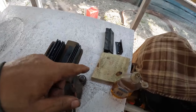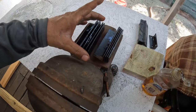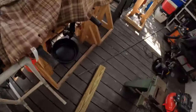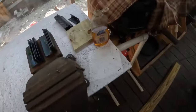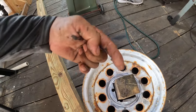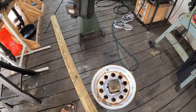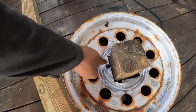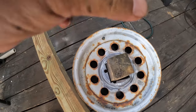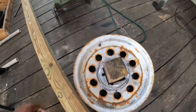I got eight of them out of that one little short piece there with a little bit of leftover, but I got my brackets for the base and then the brackets that I'm going to weld the rebar to. That's going to go from the rim welded up to one side. That's where the rebar is going to go and support it. So I'm going to need brackets that are going to go along here, bolt to the block, and then weld to the rim. And then I'll have bolted angle iron on the wood and then welded down to the rim